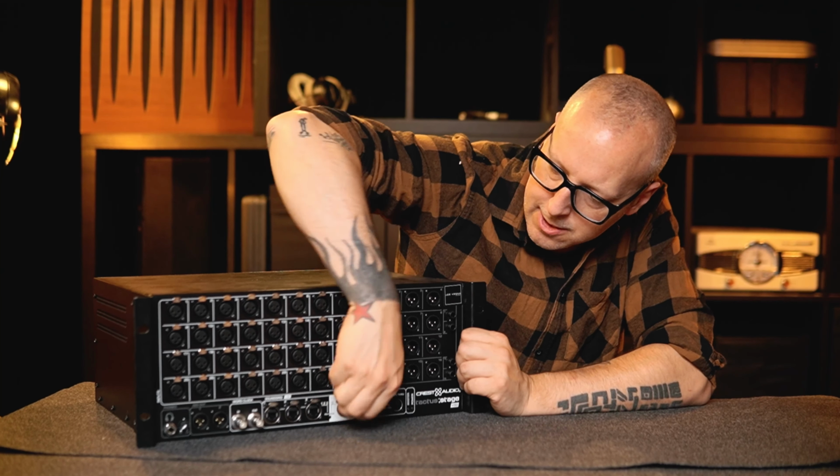And on both of these you can choose to have harmonic distortion or not. So basically you have the 2 kilo ohms without harmonics, you have it with, you have the 7 kilo ohms without harmonics and with. So it's basically 4 preamp flavors in one. And the difference is not huge, but absolutely noticeable. The difference is basically with the 2 kilo ohms with harmonic distortion, this tends to behave more like an analog console. And if you switch off the harmonic distortion and change to 7 kilo ohms, you will have a super clean signal. Really, really super clean, actually.